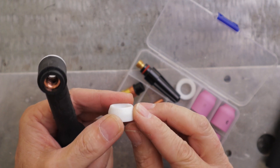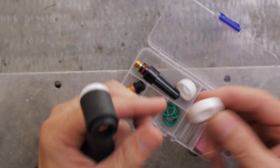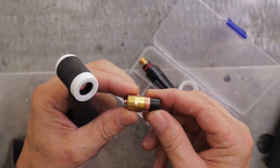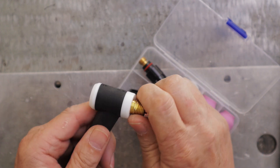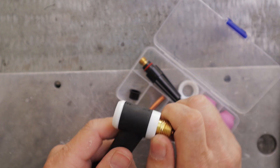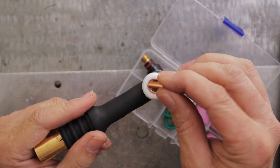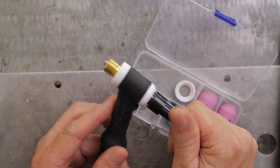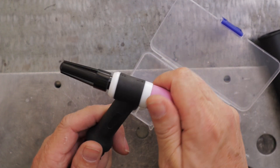The original one is kind of tapered and is for standard cups. You replace it with the stubby Teflon — it just pops on. Then take the gas lens and it screws right into the end of the torch, going through that Teflon cover and threading right in. I like to take a pair of needle nose and just give it a little snug — not tight, just snug. When this wears out I'll replace it with one of those wedge collets. Drop the tungsten in the back, put the end cap on, then screw on one of these ceramic cups — this is a number seven.